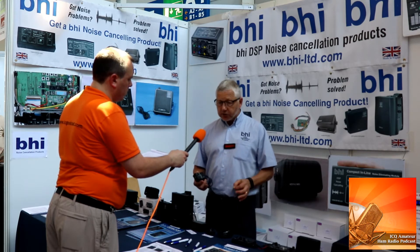So with this little box, you connect it to the extension speaker socket of your radio or transceiver. The moment you transmit, the audio is isolated via the isolation transformers and doesn't find its way into your audio — it just solves a problem. It's about £29-30. The simplest solution for most customers, as we say on the datasheet, is to buy a separate power supply first. We're selling this on the basis that it will solve a problem that you've tried everything else to get rid of — checking cabling and connections. If a separate power supply doesn't sort out the ground loop, then this little box called the Ground Breaker will solve your problem.